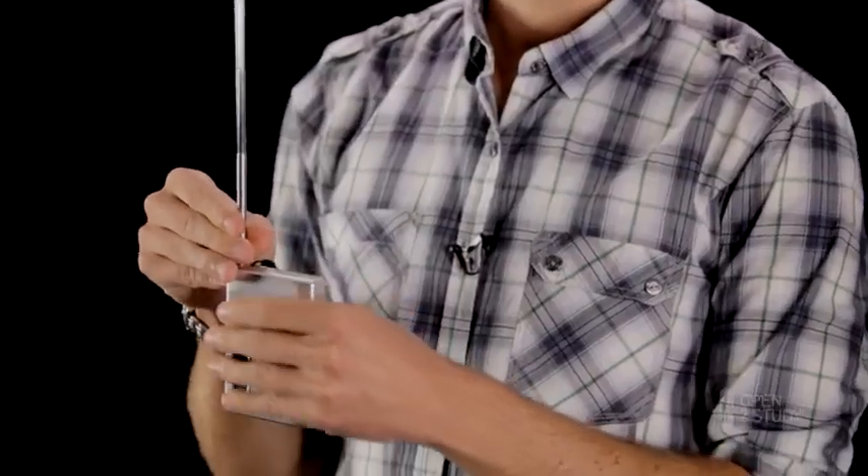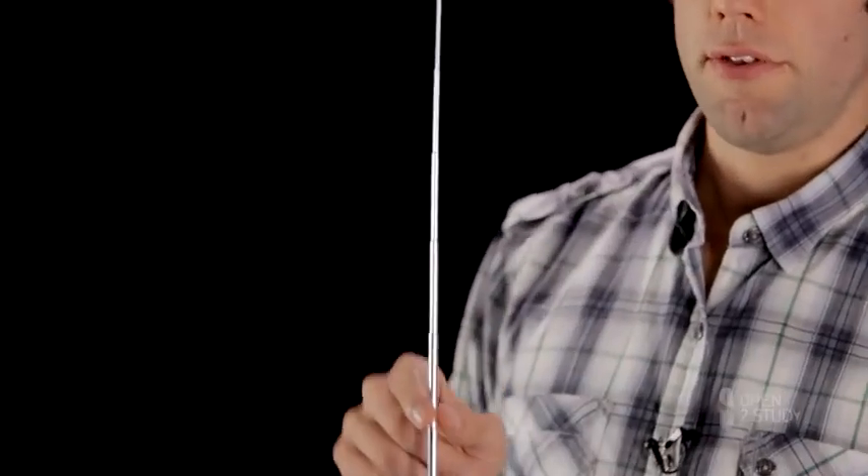So how does a radio telescope actually work? Well, first of all we need some kind of hardware that can actually detect radio waves. A normal radio will have some kind of aerial — an antenna like this. If you have an incoming radio wave, that will produce an electric field within the aerial, moving up and down, and that's the signal which is then received by the electronics. This is called a dipole antenna, and it's reasonably sensitive, especially if your radio waves are coming in in this direction.